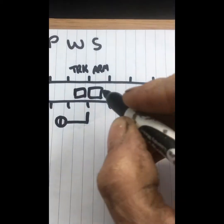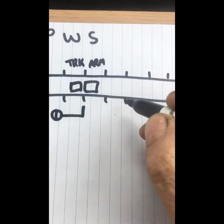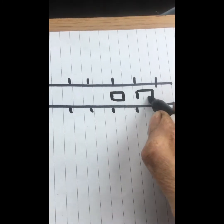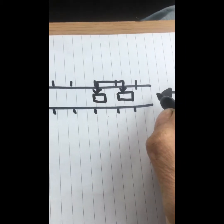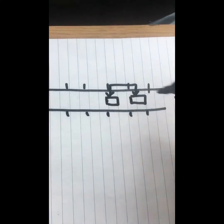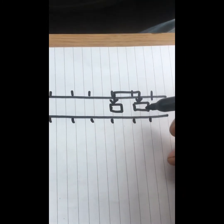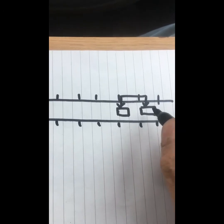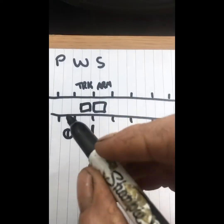You can have a train approaching a signal at stop that could be going too fast to actually stop at that signal — imagine icy conditions on the rail. So further out we will have a pair of over-speed loops set at a defined distance apart. As a train proceeds at the correct speed or less over these loops, a timing system is initiated within the electronics. As long as the train is going at the correct speed or less it will not arm and bring the brakes on. However, if the train is going too fast it will start to bring the brakes on. This system is only armed when the signal is at red.